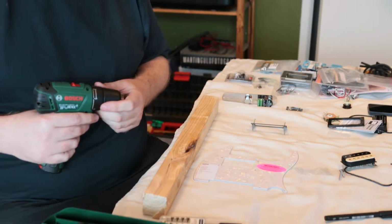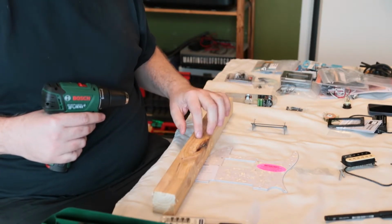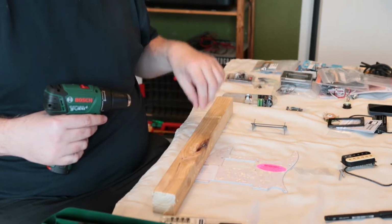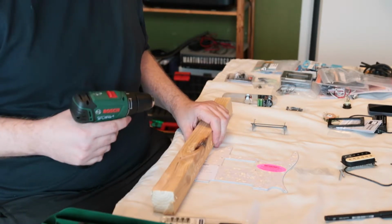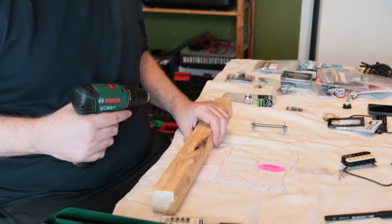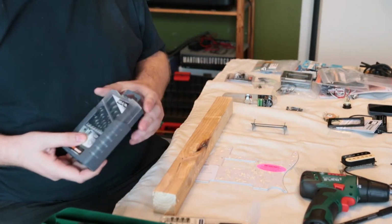And also the test drill I made in this piece of scrap wood is a much softer wood. I think it's pine or something. And therefore the actual hole is a bit bigger than this, and the stud went in a lot easier in this than it did in the guitar. So I actually think that my first assumption that the 9.5 millimeter drill was the right size was wrong, and actually I should have used the 10 millimeter drill to drill out or clean out the holes for the studs. But anyway, it's in now, and it's definitely secure and won't go anywhere.